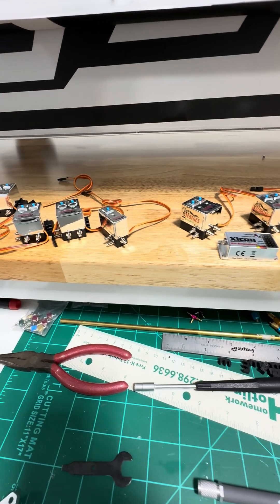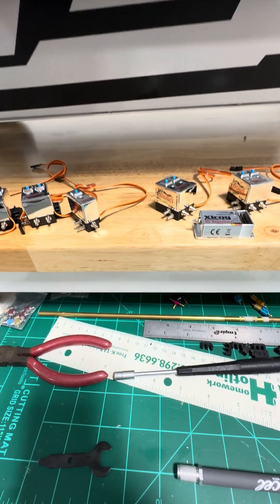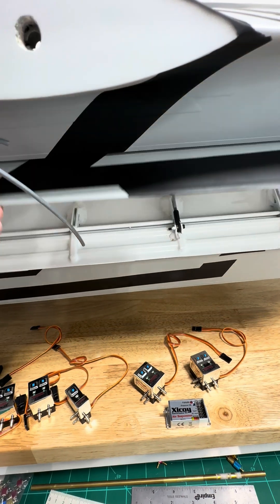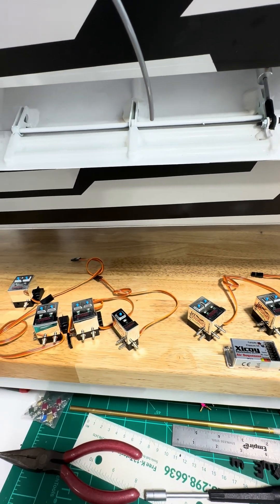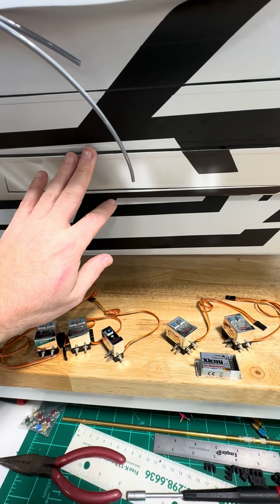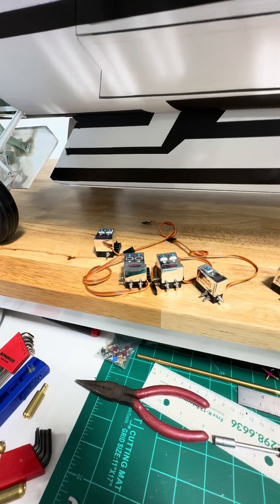I like the pulse because I can set like five or six seconds — however many you want — so it builds up pressure gradually. That way your doors don't slam shut; they do more of a scale closing. Especially on gear doors, it just seems like a bad way to do things when they're slamming against the frame, and a lot of times these things don't get full stroke before they're hitting something, so there's a lot of impact.